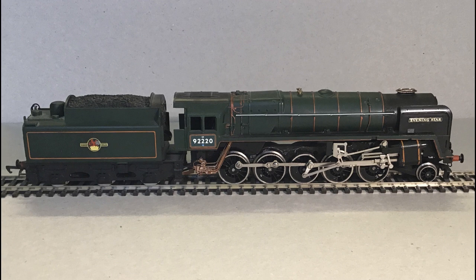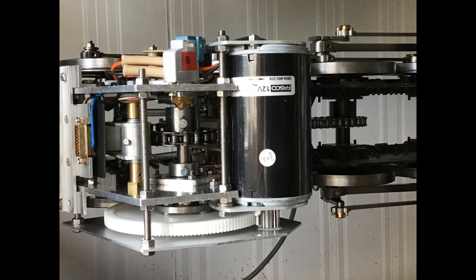At an early stage I decided to follow the Hornby approach and put the driving force in the tender. However, I did include a current-limited motor in the locomotive, primarily to cancel the friction of the plain bearings and running gear, but it also provides a modest driving torque. This approach also reduces the wear on the running gear and it seems successful.